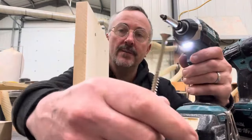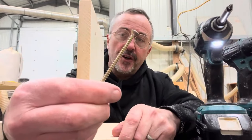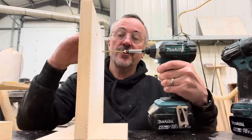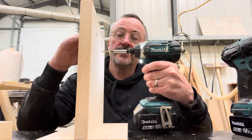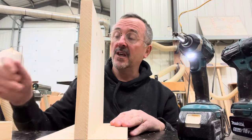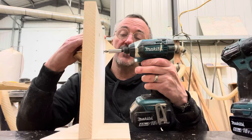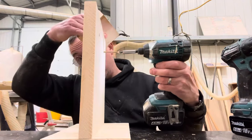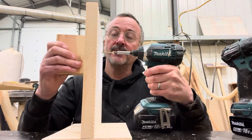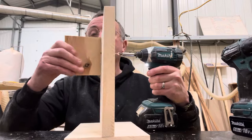Now this is the chipboard screw. If I go in with the chipboard screw in the hole and go all the way up, if I keep going it'll probably pull itself all the way through the wood. I'll take that screw out because it won't work otherwise. Holding the piece of wood on and going again — already it's created a gap, you see that? It's loose.